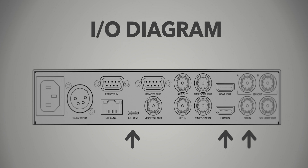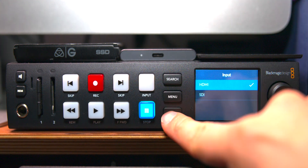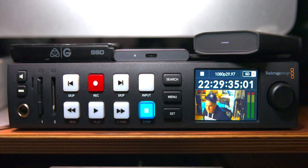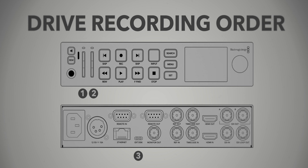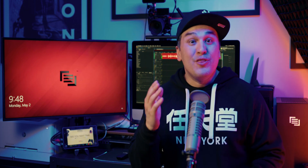For those of you that want to use the HyperDeck to record, it's as easy as 1, 2, 3: connect your ATEM to the HyperDeck via the SDI, HDMI or USB-C input, set your input and file format via the menu, and hit the record button. That said, there is no button or menu item that allows you to select between SD card slot or USB hardware. In order to select a specific SD card or USB drive, you'll need to manually eject the devices you don't want to use. And if I'm being honest, this is poor usability and extremely confusing due to a lack of clear documentation. Yes, I know you can select it via Companion or Ethernet control protocol, but those options require either downloading an app or using a command prompt.